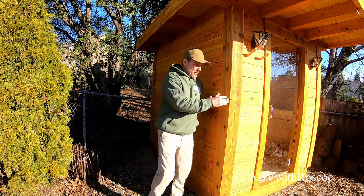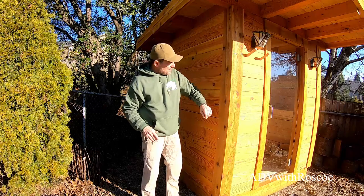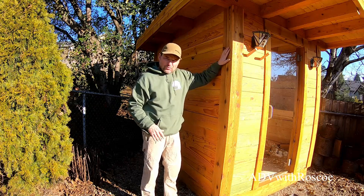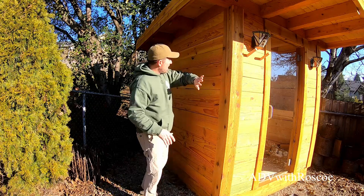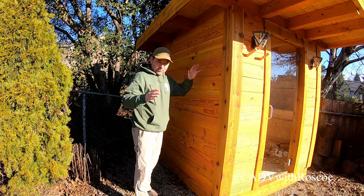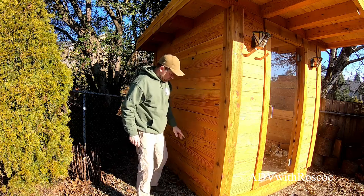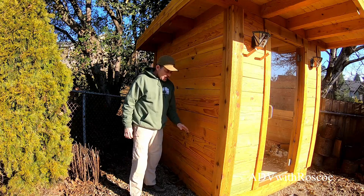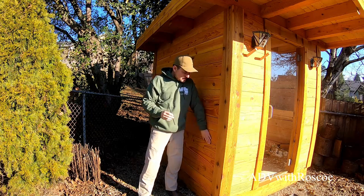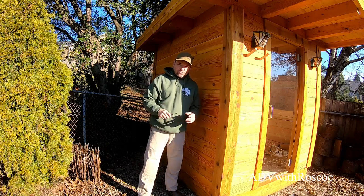After building the whole thing, I really liked the exposed corners but they weren't all perfect, so I boxed them in. Before I boxed them in, I oiled all the end grain — I think I had 3 quarts of oil on the end grain — then boxed it in and sanded everything. This thing is sanded inside, outside, the ceiling, the walls, everything. There's about 3 to 4 quarts of oil out here, which is also why I made such big overhangs — I didn't want any rainwater splashing since this isn't cedar.